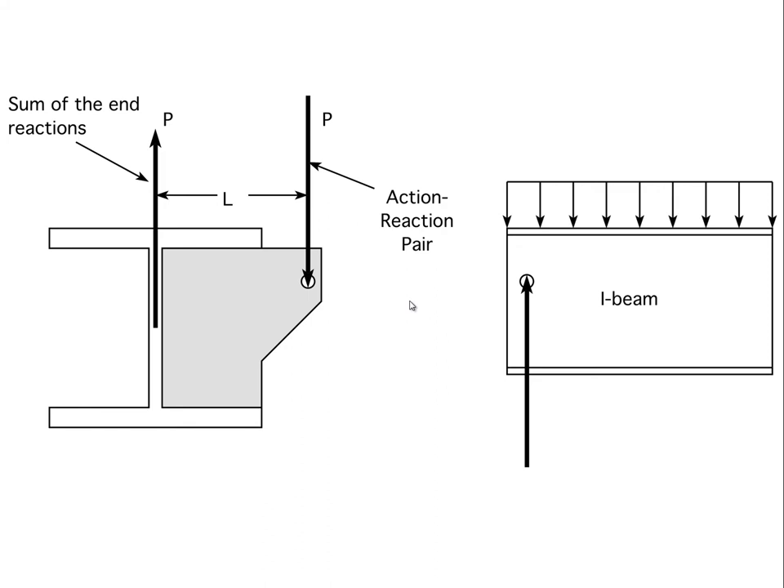This is a diagram where the center of support under this girder is on the center line of the girder. This load is an eccentric load which has a lever arm L, tending to create a moment which is tending to rotate or torque the beam around its center line. The loads from the secondary beam are fairly substantial, and you might have several secondary beams, so there would be a powerful tendency for this torque to rotate the primary beam.